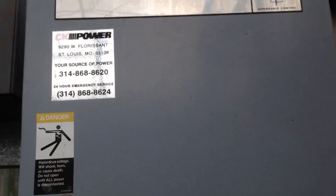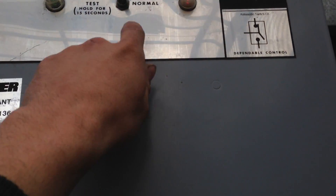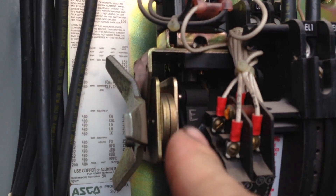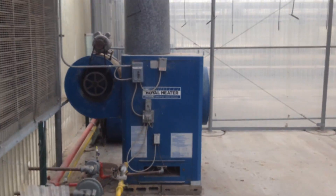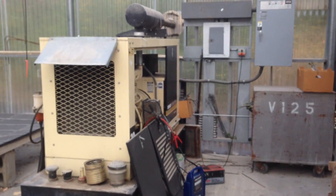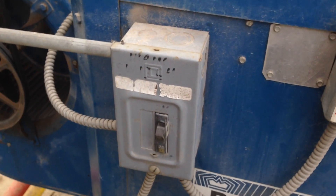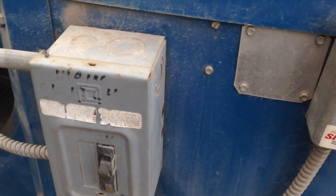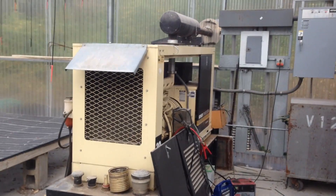What we're going to do here is a whole load test. You can see we're switched over to E, which is emergency backup power, and the red light is on. So that means this heater over here is going to be powered by that generator. So when I put the main switch on, put this in manual, put the switch on, it should start drawing power from the generator.